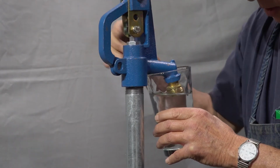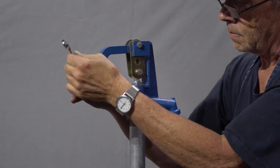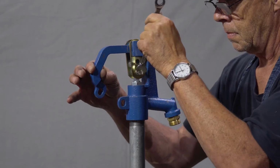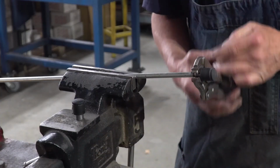If the water does not drain, the plunger needs to be lowered further to open the drain for backflow. This is completed by repeating the aforementioned steps. If the leaking continues when plunger adjustments are no longer an option, the installation of a new plunger is necessary.